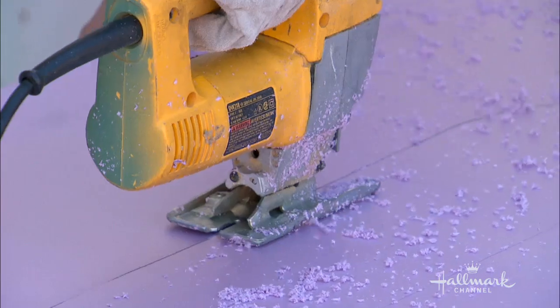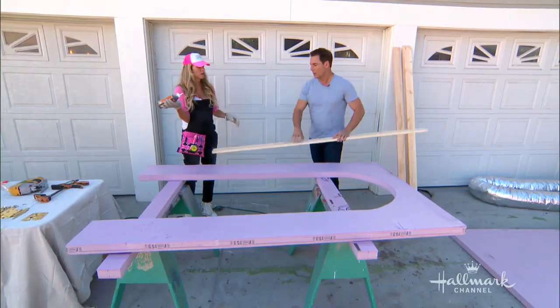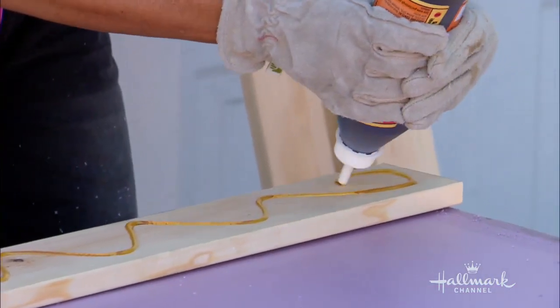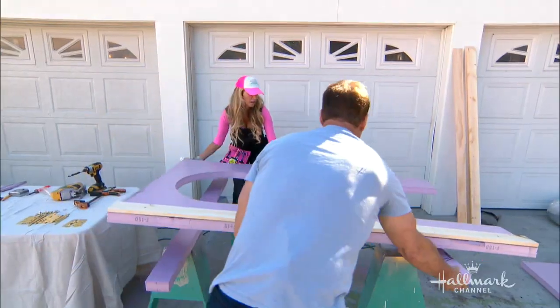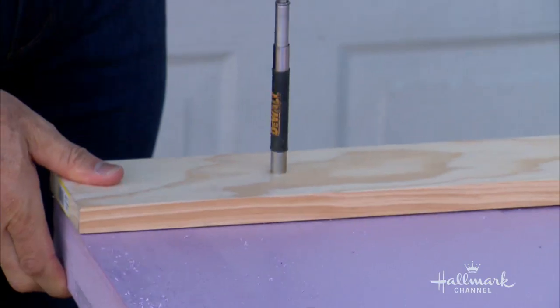This is what we did earlier today. We started off with these sheets — they were four by eight. We cut them to four feet by six and a half. You can really put it whatever height you'd like. Once we cut our holes out on both sides, we took one by fours, put a little gorilla glue on them, and put a few screws in. You could clamp that while the glue dries, but the screws are a nice way to do that. We put it on both sides.